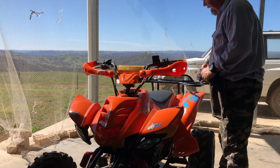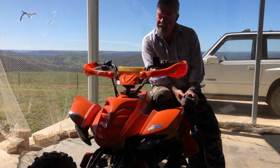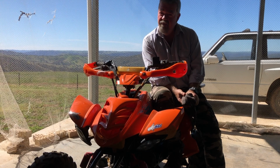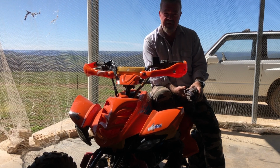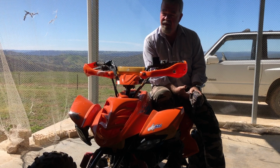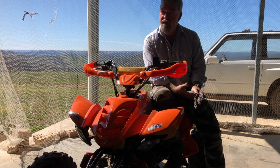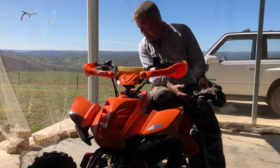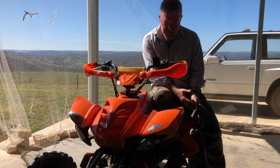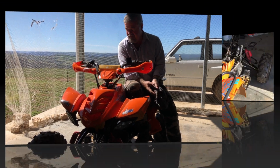Well, unfortunately, it looks like there's a fairly good fuel leak at the carburetor, on the fuel line heading into the carburetor, because it seems to be just falling out the bottom of it, and I can't tell if it's a seal or if the overflow is blocked open by some other crud. But it's got a pretty good leak, and a lot of that leak is going over the exhaust, and I don't need a fire while it's in there.